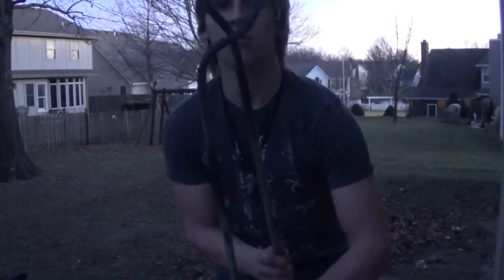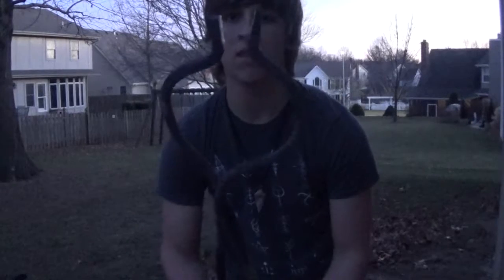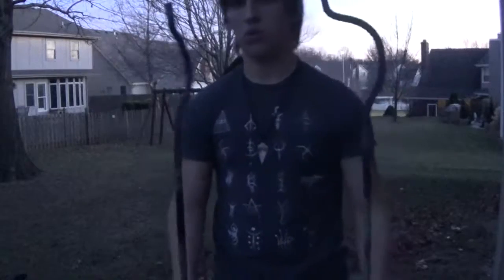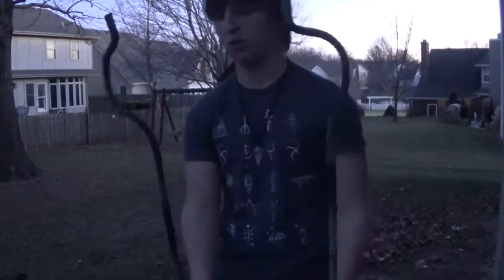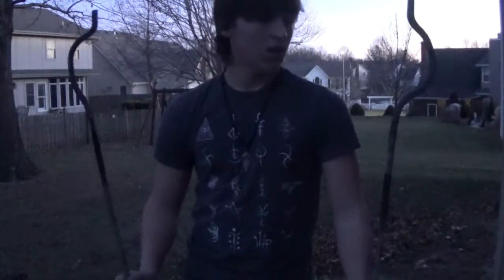But, you know, if I were to connect them somewhere like that, it would still come together and function as tongs. So what I'm going to do is I'm going to take them to the grind wheel. I'm going to flatten out the tips here a little bit more so that they hold something a little better. Then I'm going to grind away a small section where these intersect, and that's going to allow them to slide together more easily. Then I'm going to drill a hole and put a rivet through them. So yeah, let's take it inside to the grinder.